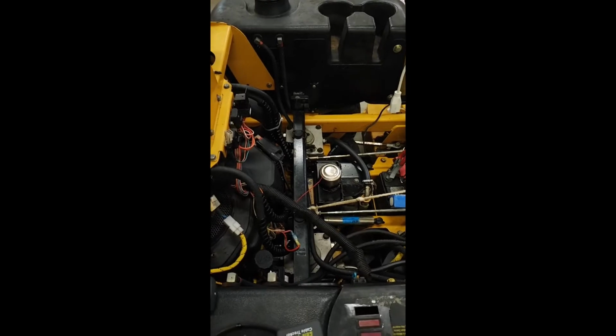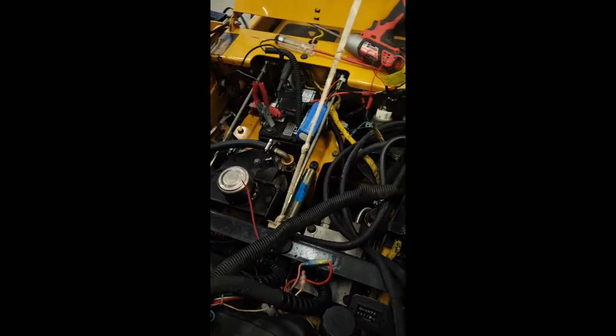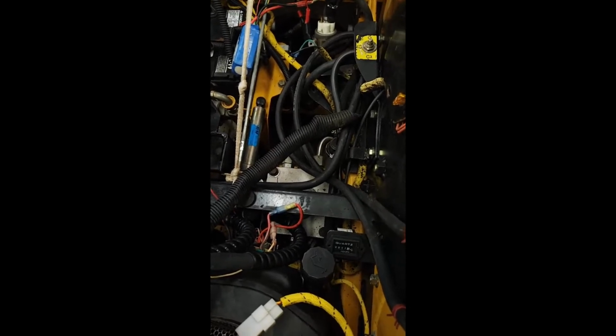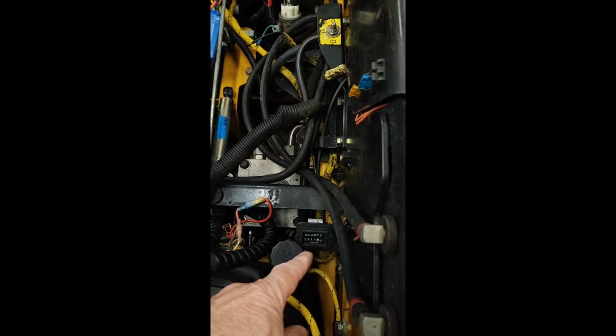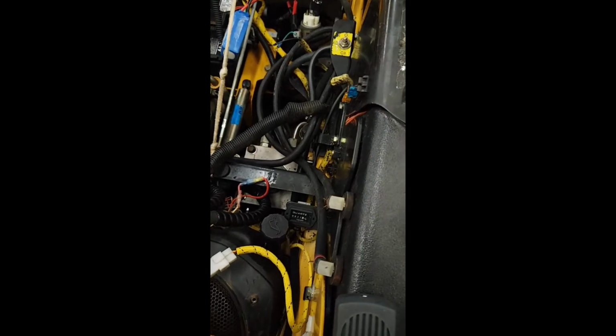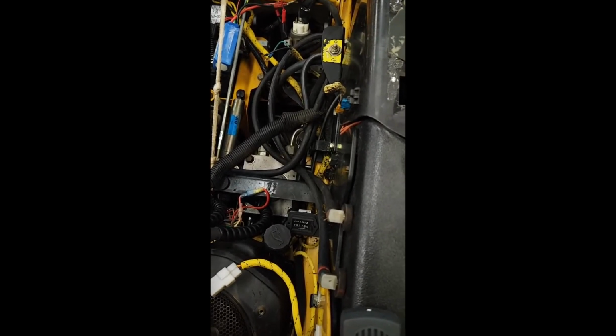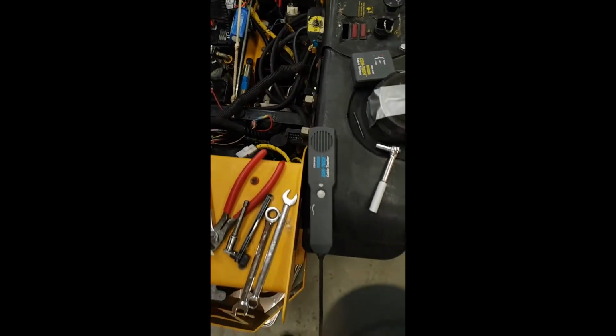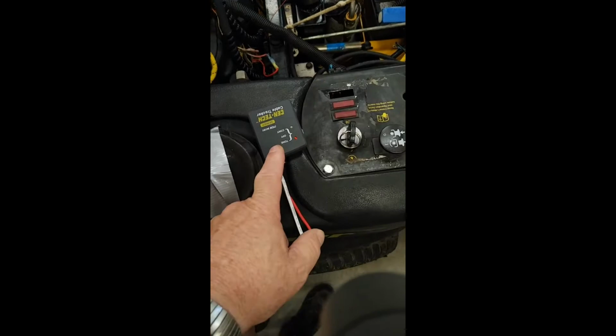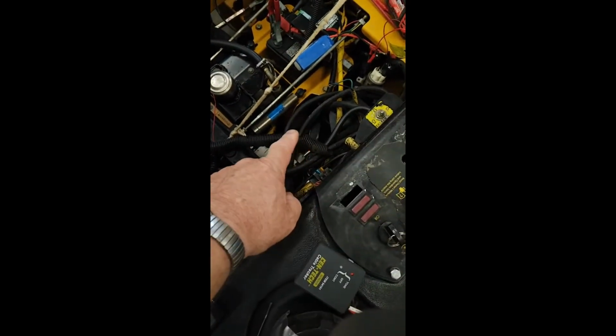We did top off the hydraulic fluid right down here, which is a 20W50 motor oil. As a matter of fact, in this particular machine, the manual called for a 10W40, and we don't know how many hours it's got on this machine. So I put an hour gauge on it temporarily, just to keep up with what I'm doing with it. As you are aware, if you've been watching my videos, this was a temporary analog hour gauge that I had on the RSD to try to bring it up to the original hours, because the key was left on by a couple of dealers for quite a few hours. I think they left it on for a total of like 19 hours, I'd have to look it up. Anyway, that's a little bit of update on the machine, and we're back to using our other diagnostic tools to find out where the problem is here in the wiring.